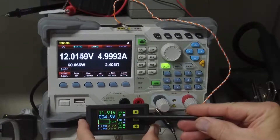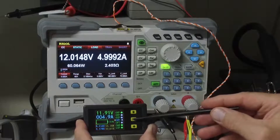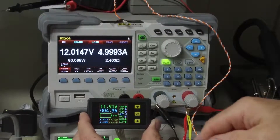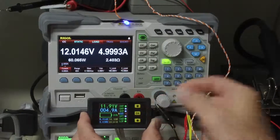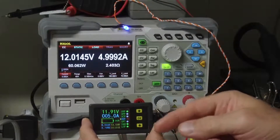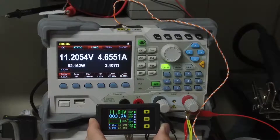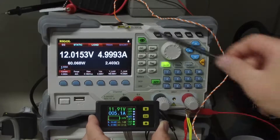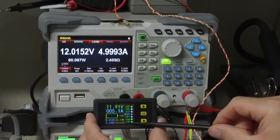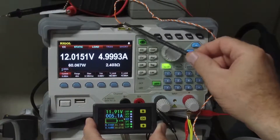The active indicator is this little square yellow box here. I have it next to the 'out.' If I push the OK button, it should enable the system — i.e., turning on that relay — which will turn on this blue LED. There we go, it's on. The arrow is pointing to the left, which means current is going into my simulated battery. I'll reverse the current. And it turned off because it sensed a drop in voltage and I have the under-voltage protection turned on. You can see that the relay turned off.